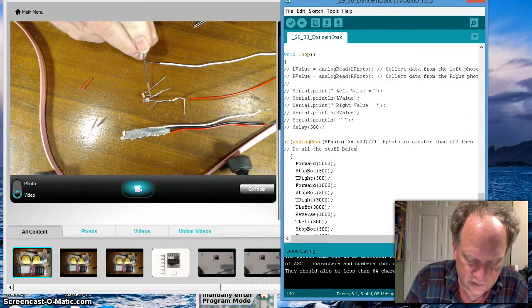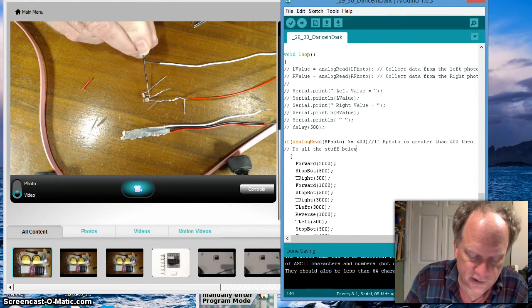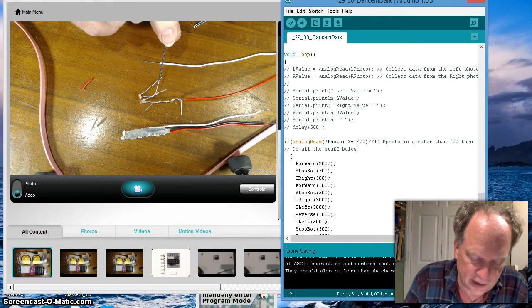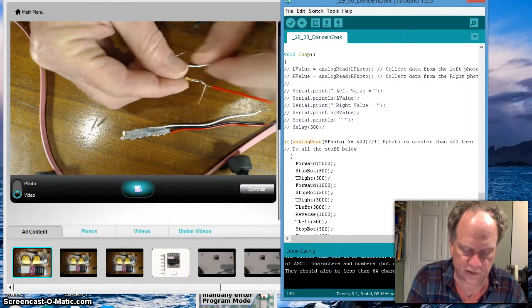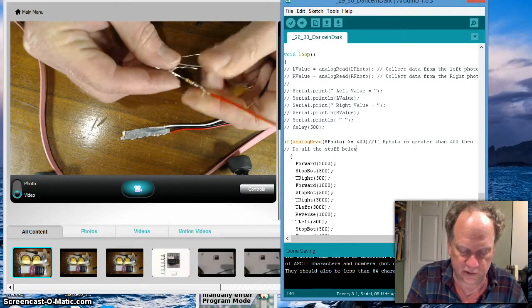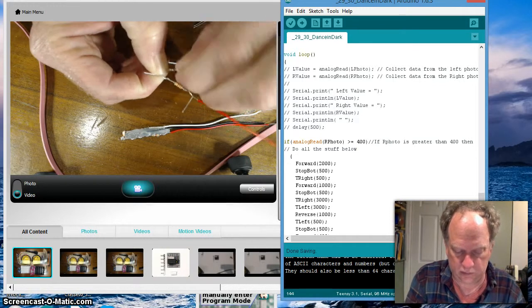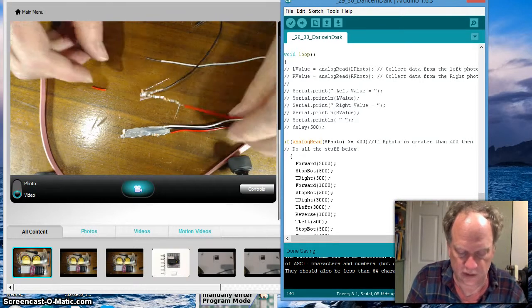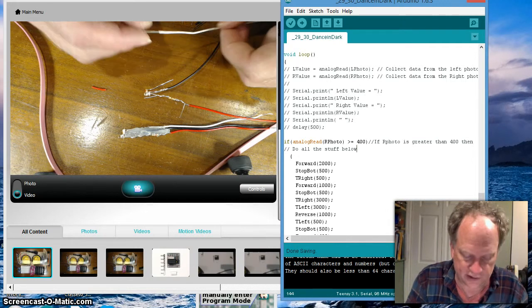This side here, one of the wires from the LED, I'm sorry, the photoresistor goes to ground. And of course, the LED has to go to ground to complete the circuit. Okay? So let's put a black wire here. And again, boy, if you have a soldering iron, you could eliminate this whole slipping problem. Okay? And last but not least, we'll use the white wire or the yellow wire as our signal wire.